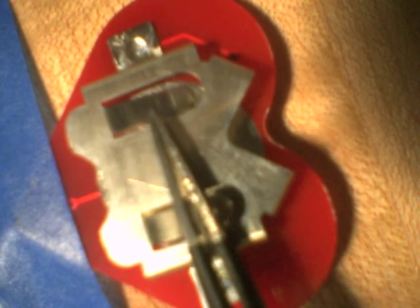There you go. All right, I'm holding it down while it cools with my tweezers. It's not quite in the right place, but actually this thing's pretty flexible, so you can just twist it like I do there. Hold it down with the tweezers. Oh, I twisted it while I was heating it, right? Almost always that's the case. You really don't want to move a component without heating it. So I've got it straight now.